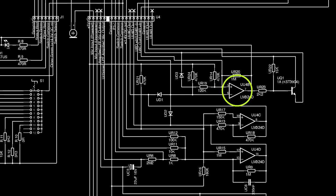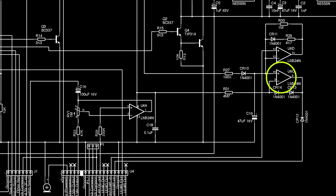But it can't do much to block it if pin 10 is being dragged high, either by U6D or by the test mode supply. It's all really weird to me, so I think the best way to find out what's going on here is to just scope it all out.